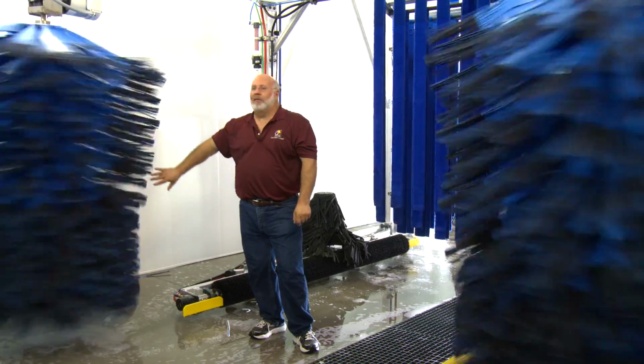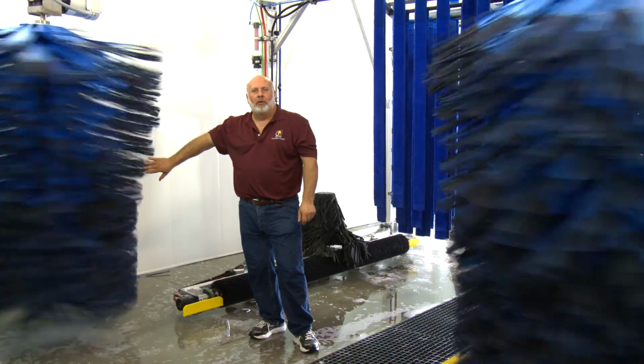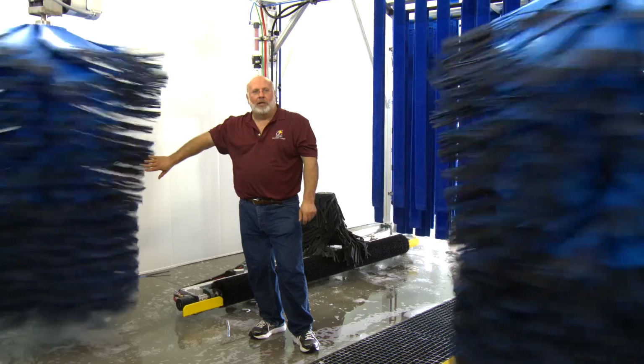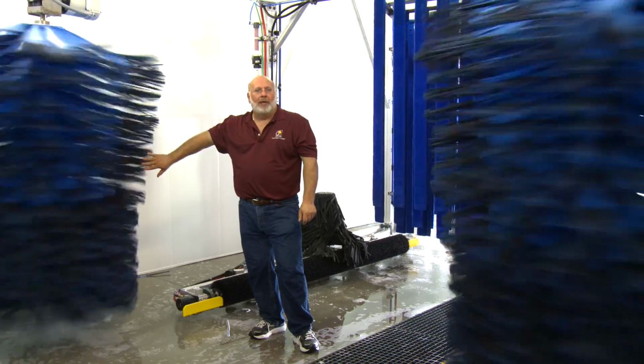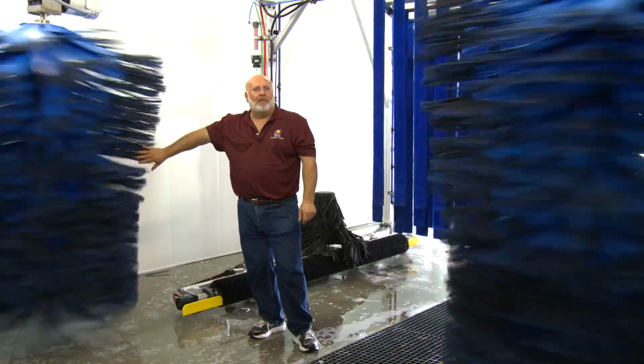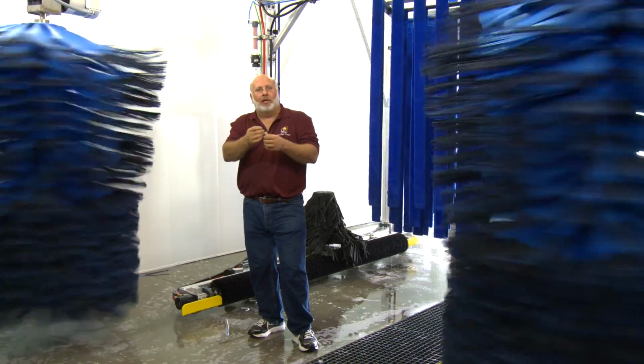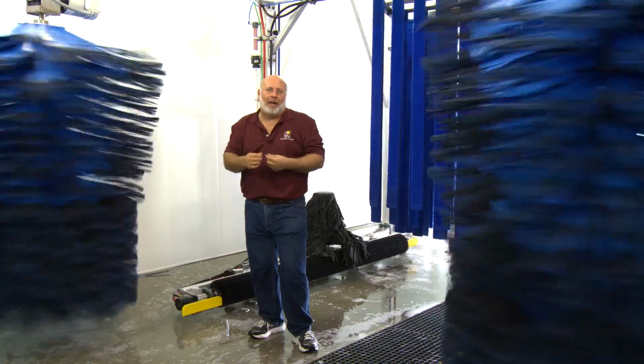These gearboxes up here are 20-to-1 gearboxes. So basically on an 1800 RPM motor, it means we can run approximately 90 RPMs. We don't need to go quite 90, so we'll set it at 55 RPMs. And then we're going to go back and attach a little piece of wire or tie wrap to one area. And again, we can time this out.